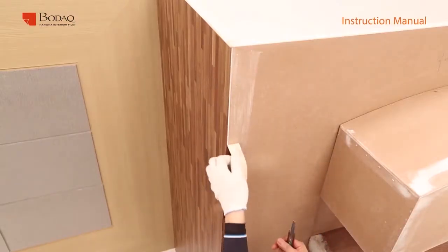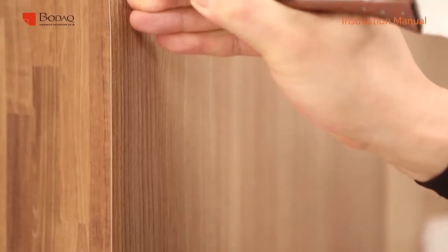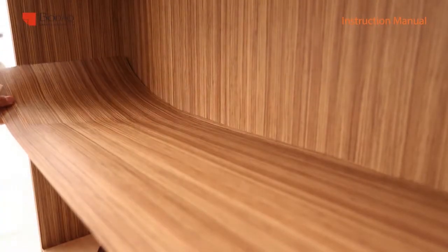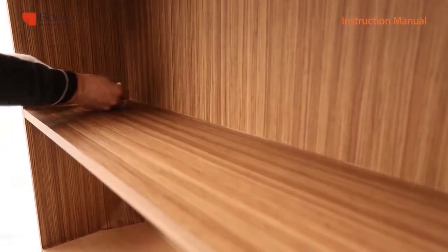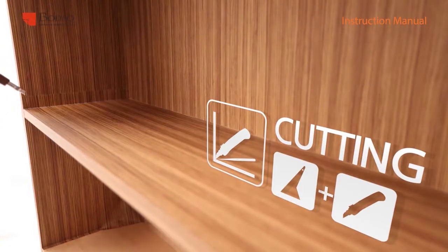After applying film on a part of the edge first, apply the rest of the sheet along the edge direction. And neatly finish the extra remaining parts of the applied sheet. The inside corner is the same as well. First, apply film to one part of the inside corner and squeeze it to the opposite side. And trim extra film strips with a cutter.